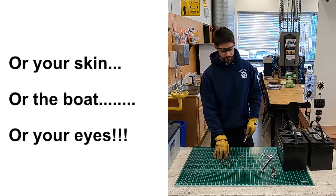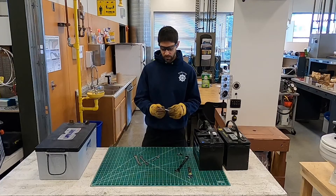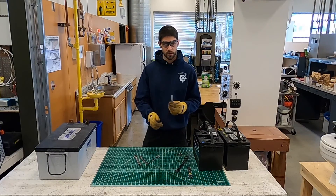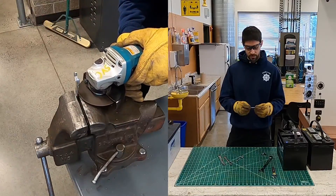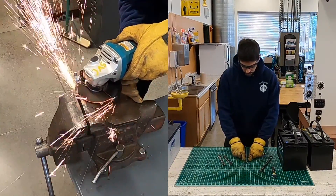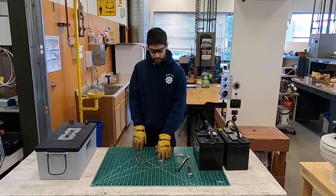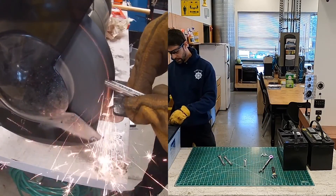So we've got a nine-sixteenths and a half inch. We're going to take them over to the bench grinder and the vise. I'm going to cut them down with a thin cut-off disc, deburr them on the bench grinder, and you're left with an end result that has two small enough wrenches that you're never going to dead-short the battery.